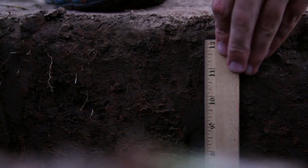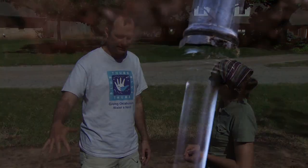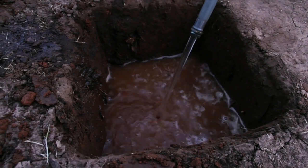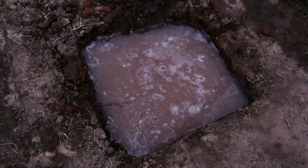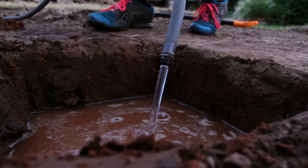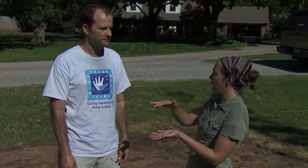We've had a lot of rain lately so the soil is pretty well saturated, but you can water your lawn for a while if it's been dry. Then fill the hole a couple of times and see how fast it drains. The homeowner did that — it drained in 11 hours the first fill, 12 hours the second, so we can get the maximum depth of a rain garden in this soil. If it drains more slowly, we'll want to go a bit shallower.